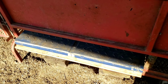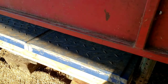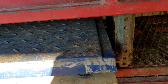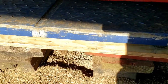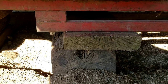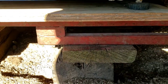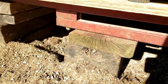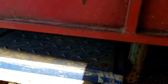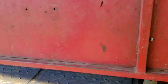We slid this underneath here — the sun's on it so it's kind of hard to see, but it's just got a piece of plywood underneath because the scale is just a little bit wider than our alleyway, so we put a piece of plywood where it'll sit on there. Then we blocked up underneath our raised alleyway because it would give a little bit and throw your scale off. Block it up solid, then adjust the feet of your scale so it sits level — make sure it's flat and not wobbling back and forth when you set it in there.